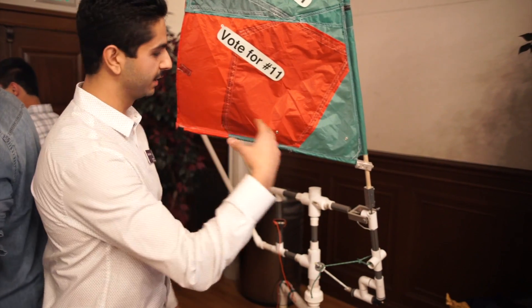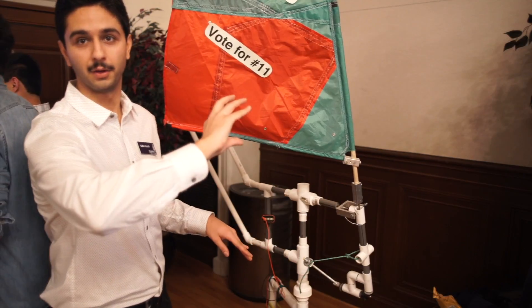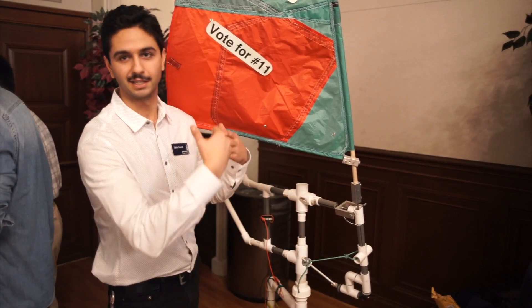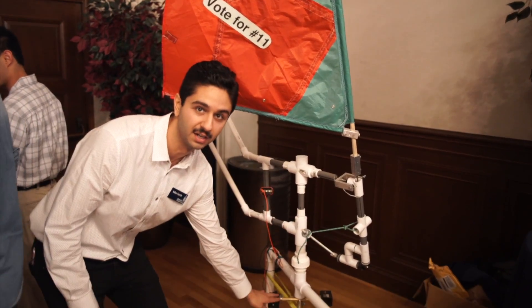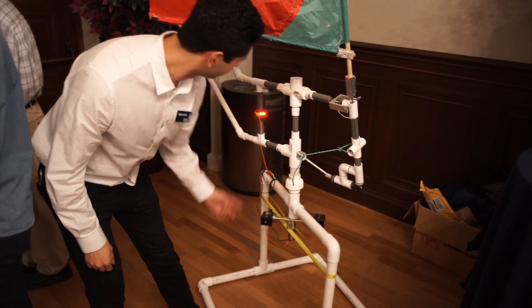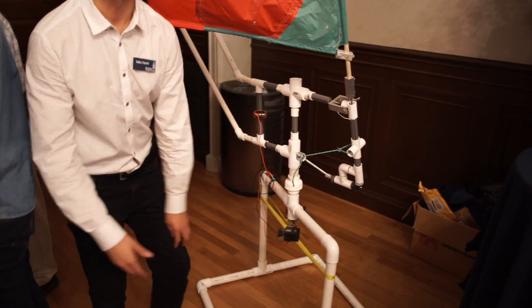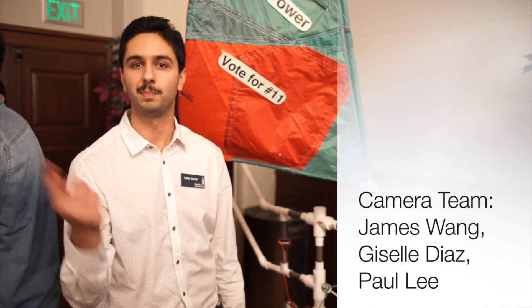The oscillatory motion of the sail basically rotates the shaft one way and another way. In this assembly there are two bevel gears that translate that side-to-side motion into a one-directional motion of a shaft. There's a flywheel down here that gets spun by the whole sail and basically makes power — you can see this LED lighting up as a result. When it's working really well and flipping hard, the idea is to get the flywheel to spin relatively quickly and make a bunch of power.